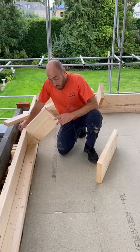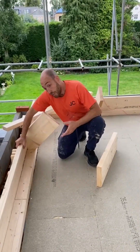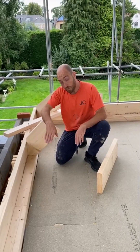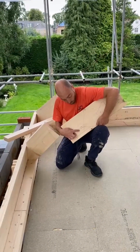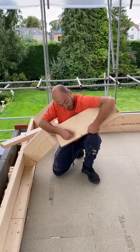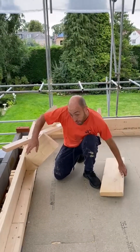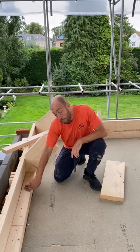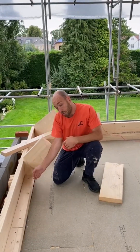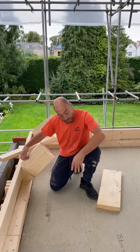Good work tips — doing a bird's mouth. We're sitting in tight to a set base which is a parapet, so it's completely different to your standard rafters on a plate. I still mark that on as I would normally, with my one-third depth and one-third bird's mouth out. Once I've got my seat cut, my plumb cut I cut off. When I do this plate at the bottom, I make sure it's cut onto a joist, I run another one across the top so I stagger the joints, and I like to fix a backing board on it so it's nice and tight — it takes all the twist out.